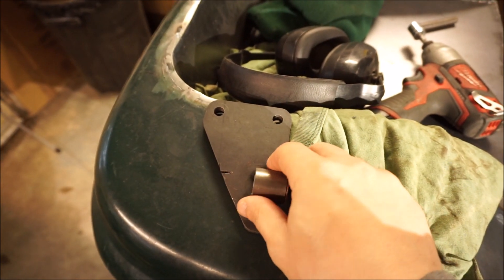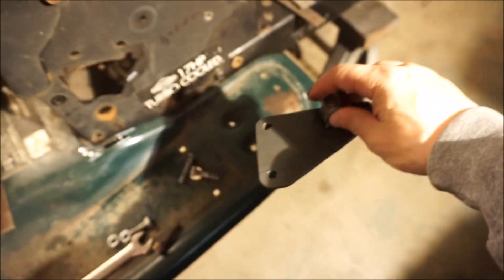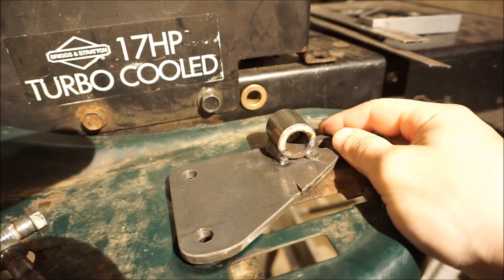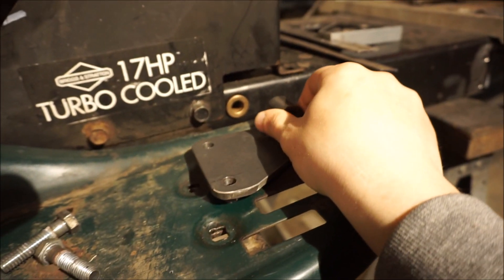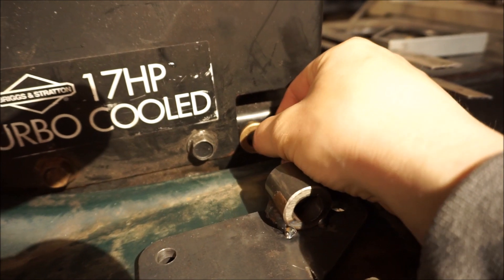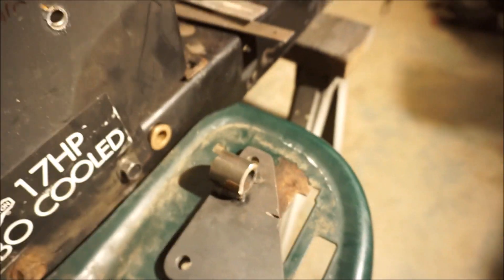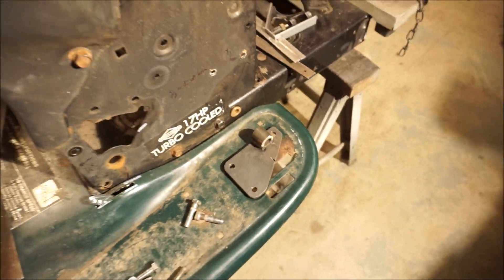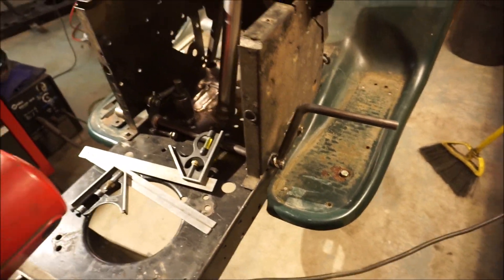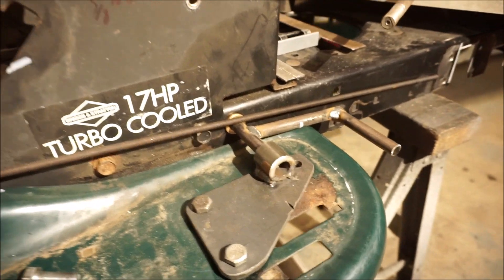Jumping ahead a little bit — I got my piece made up with those little standoffs, mostly just tack welded on. They're basically washers in location so it'll sit nice in that indentation. I got the front part welded on already, let it cool plenty before putting the impregnated grease bronze bushing in. I've got that one in there; I still need to peen the hole in the frame or do something to make it stay in there better — it's tight radially but it'll slide right out.